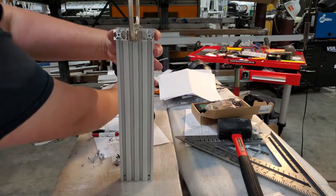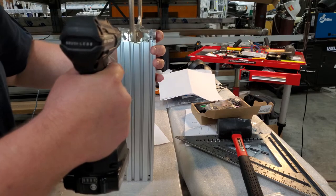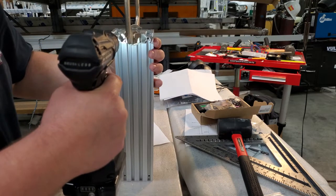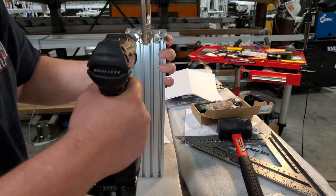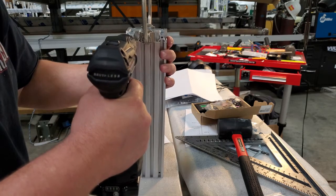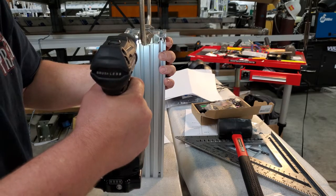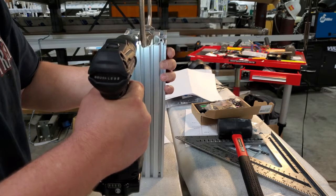Of course you're covering these two holes — that's not really going to matter. I'm going to take a 5/32 drill bit that fits right in here, and what it's going to do is that one inch of material is going to line my drill bit straight up, so as I start to drill through I'm right center, right where I want to go.